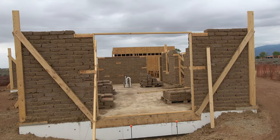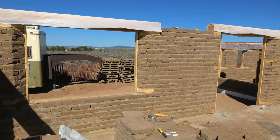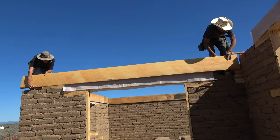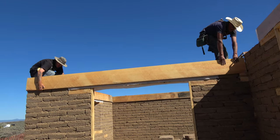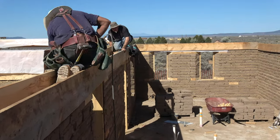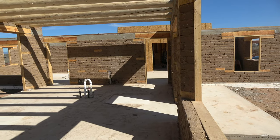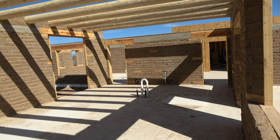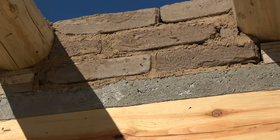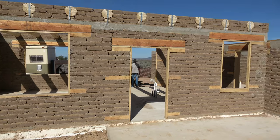Each window and door in the house will take a header, which we call a lintel. It's an eight by ten beam that is placed over to span the opening. The next step is that we form a bond beam around the entire perimeter of the house. It is a minimum of six inches deep and ten inches wide. The purpose of the bond beam is to disperse the weight evenly over the Adobe walls. Once the bond beam has cured, the forms are stripped and the vigas are rolled up. The vigas are placed approximately 30 inches on center and shimmed to where there's a level surface to build the roof off of.